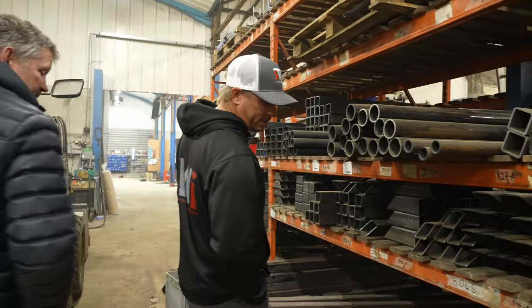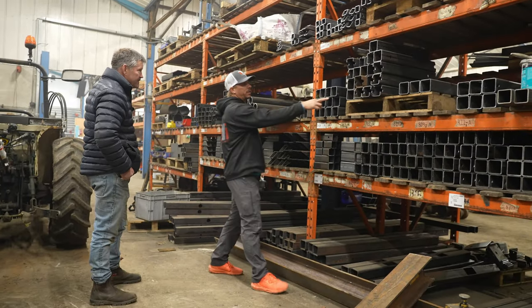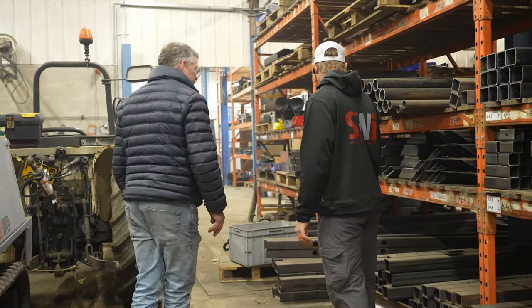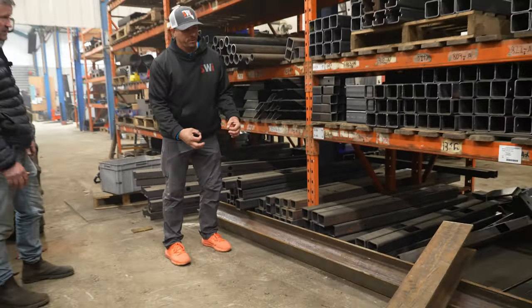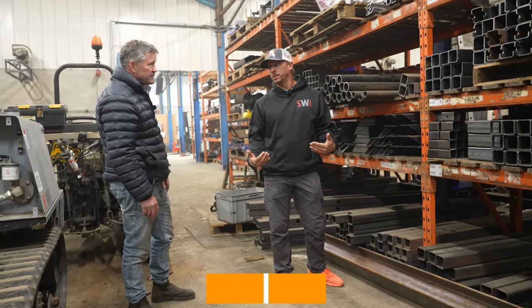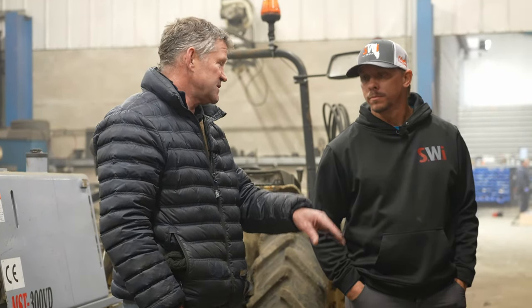That's the mast I-beam, and most of the stuff is for Solo Nets. All the parts come in laser cut — perfect cut every time, and you get better quality out of it. As we mentioned when we saw the Solo Track, one of the key features is that this is an I-beam rather than a welded beam, so there are no welds to break on it. The problem with welding is you create stress in the steel, and unless you heat treat it at vast expense, you're going to have that stress in the weld all the time. So the bit that's doing the work has no stress in it.